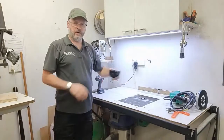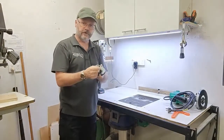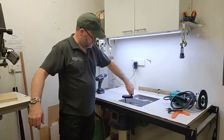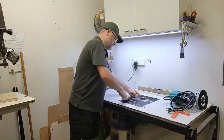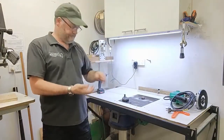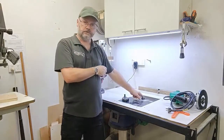There's a winder handle that comes out of the table. It's got a hexagonal drive like an Allen key on it. It goes into this hole and we can rotate it, and the collet of the router comes up out of the table. Now because the router is down a little ways underneath the table, this is in fact what's called a collet extension.